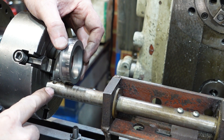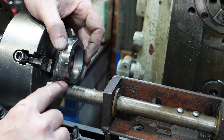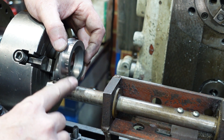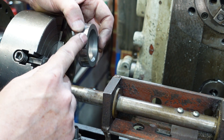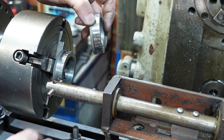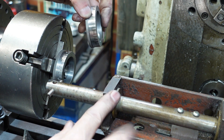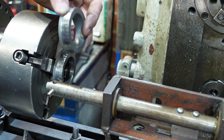I've just re-graduated the dials. Because this does one revolution for two millimeters of travel, each major mark represents 0.1 of a millimeter. The 0.05mm graduations are a bit of an extravagance but they're filling a space — the graduations on the previous style were ridiculous given the precision of the instrument. I'll come along and put numbers on there. This graduation setup is something I also used in the Taylor Hobson video. It's one of those bits of kit you make up thinking you'll use it once and it ends up being quite useful.